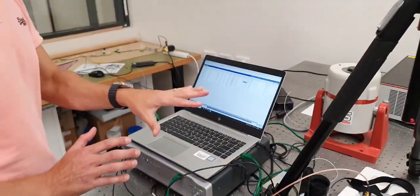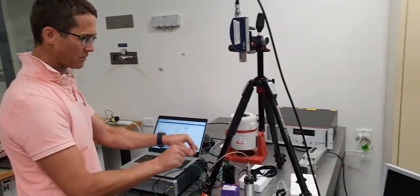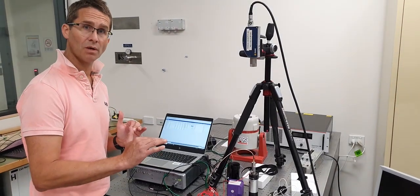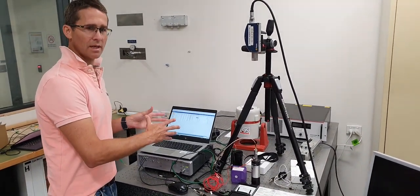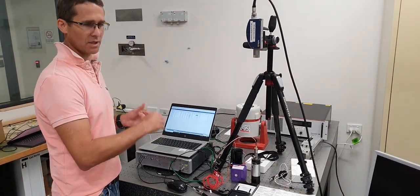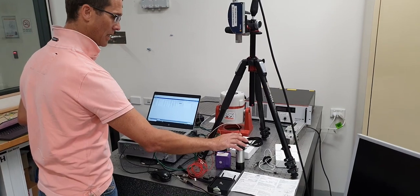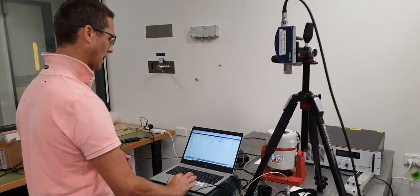The important part of this process is that we need to calibrate this optically conditioned transducer to give a flat frequency response, and in this case the optoelectronics are not necessarily, as manufactured, giving the kind of flat frequency response that we need for a transducer. So step one is going to be to have a look at the response for a single frequency, and then we'll do broadband calibration subsequently.